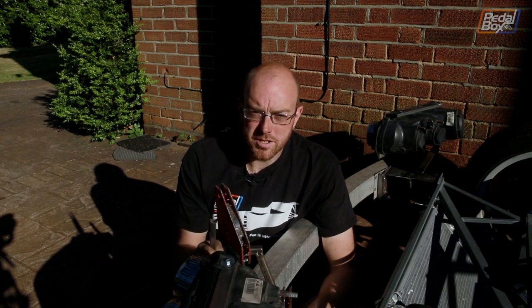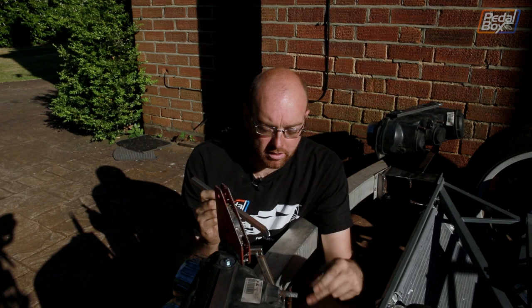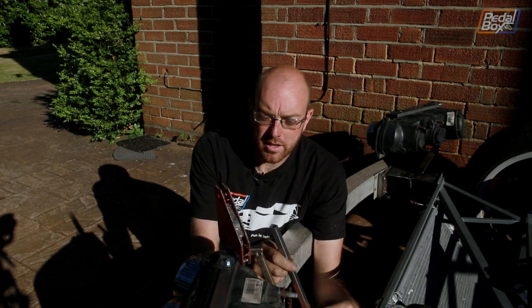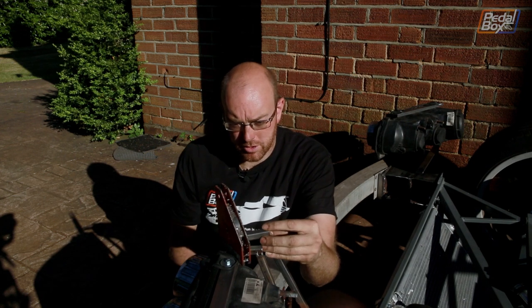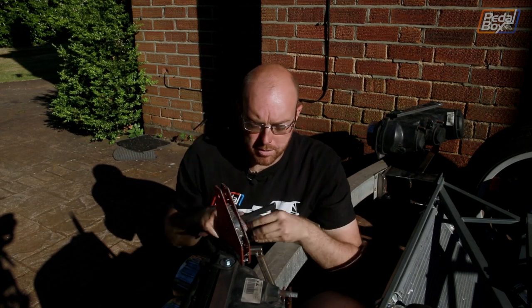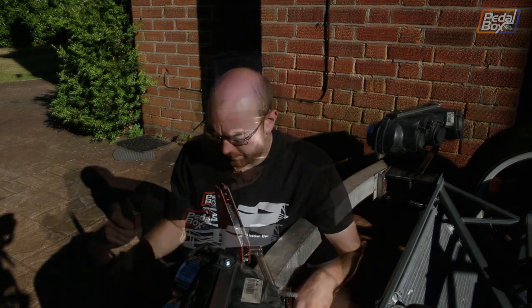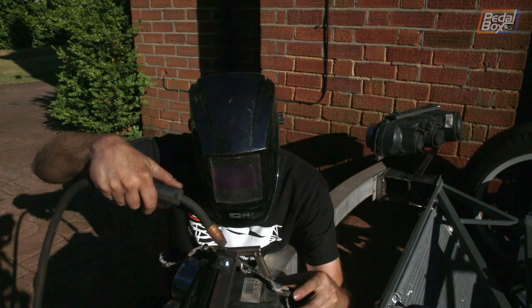So the inside edge rear stay is just going to be made of some half-inch box. This has been cut at quite a sharp compound angle, and it fits nicely into the middle of the support that holds the front beam. That goes up to the top, and then there's a short piece of dead straight tube, which just sits on the top and will be welded onto the end of here. I've got it clamped up and ready to go, so I'll put a few tacks on. I've put a heatproof mat down so I can tack it in place and not risk melting the light.